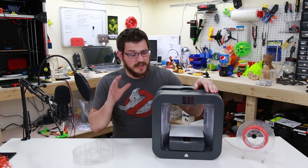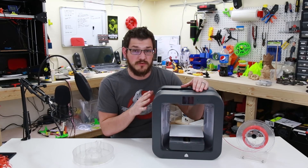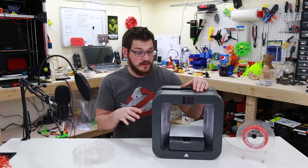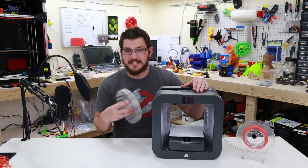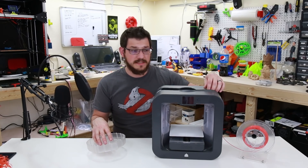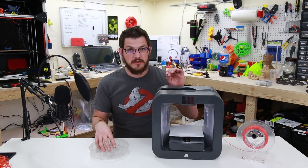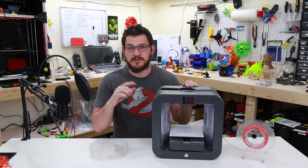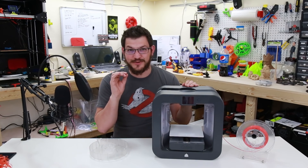I hope you enjoyed this video — there are a ton more videos to come with this printer. I'm going to do some print videos, an overall review pre- and post-modification, and videos on how to actually modify these cartridges to accept other filaments to make your life easier. I'm also going to show an easier way to mark them and redo the tube system, because it uses 1.75mm inner diameter, 3mm outer diameter PTFE tubing, which makes it super duper thin.